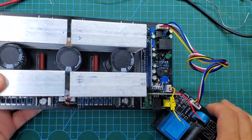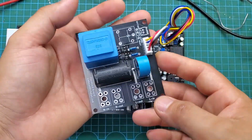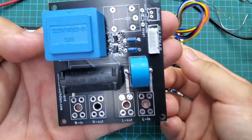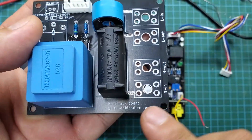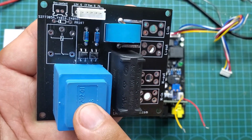This is the feedback board, which functions for both voltage and current feedback. I use a small transformer here to isolate the 220 volts from the 24 volts, making it safer for the user. The feedback board will be connected to the main board through a cable.